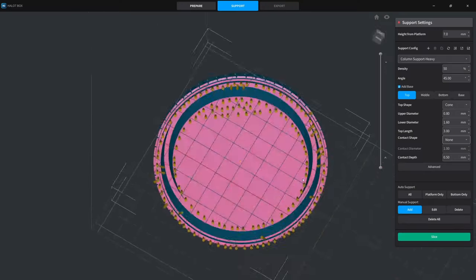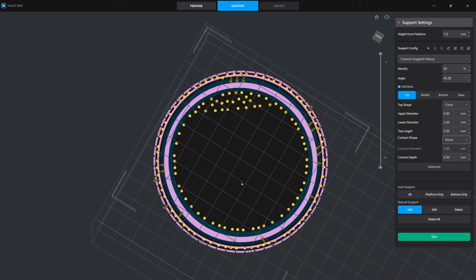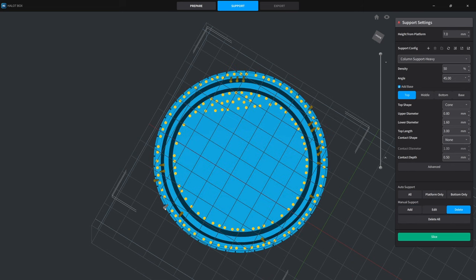If we roll it and then roll it back, we can see it's done a lot better attempt at doing it, can't we? It's also got a lot of things wrong, like that one, that one, that one, that one, and that one. You just don't need it. The structure of the thing you printed is strong enough to not need these like corner supports. So if we get rid of them and then you go around, and it's up to you. If you want to risk it for the biscuit, you can.